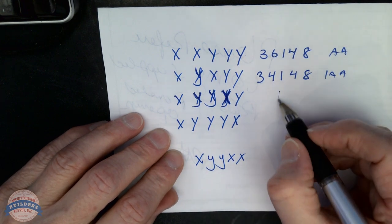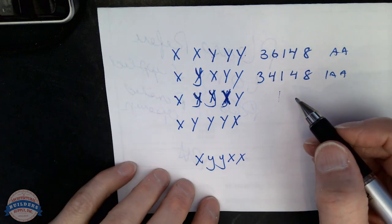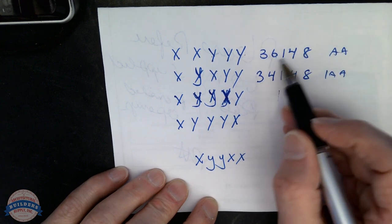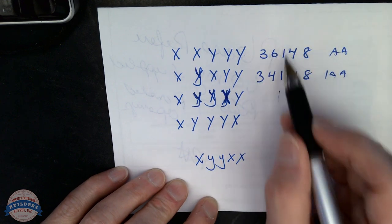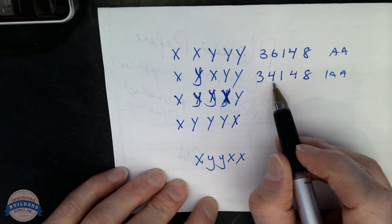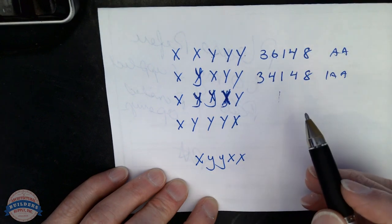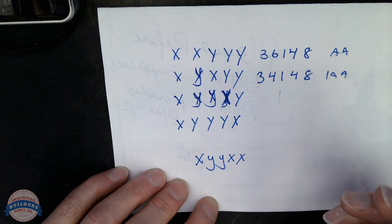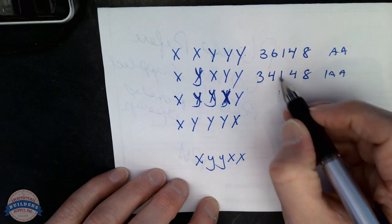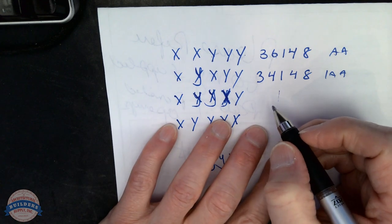So now what I'll end up doing is rotating this column, except it's important to explain all of the positions that didn't get rotated are the same biddings as the master key. So I rotated the second chamber, but every other key, therefore, would be the same as the biddings in the master key. That's the principle of the rotating constant. In my second change key, that means I'm going to rotate this third chamber, because I rotated my second chamber.